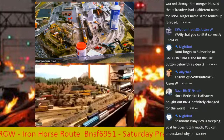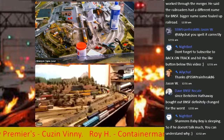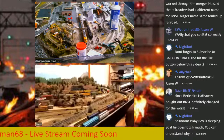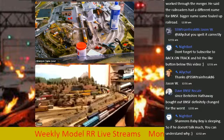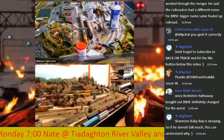With 15,000 feet of train, you're going to get slack action. It's going to happen. If you've got power in the middle, power in the head end, power on the rear, all on DPUs, you're going to get slack action, and they do break. Well, this one only had 3 units at the head end, so I think they might have been coming on a downhill section. Maybe the back end of the train slackened up, kind of catapulted it forward, and then when the head end pulled the slack back out, it just launched it. Or they could have been applying the brakes slowly, and the brakes latched on at the back end a bit harsher than the front end.